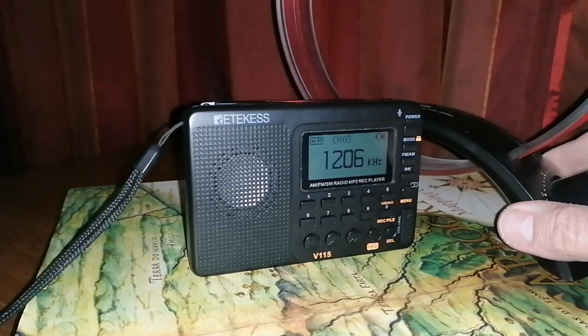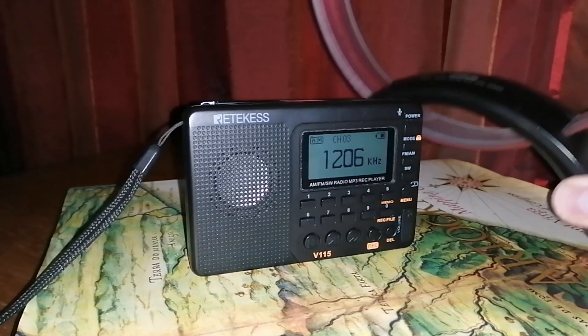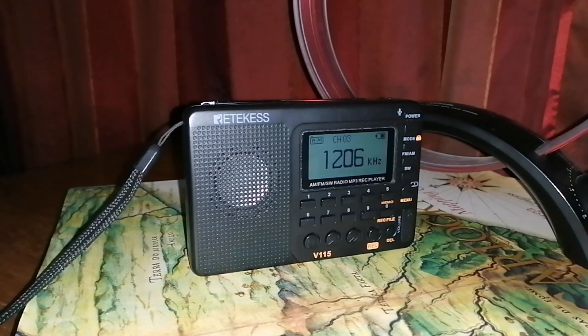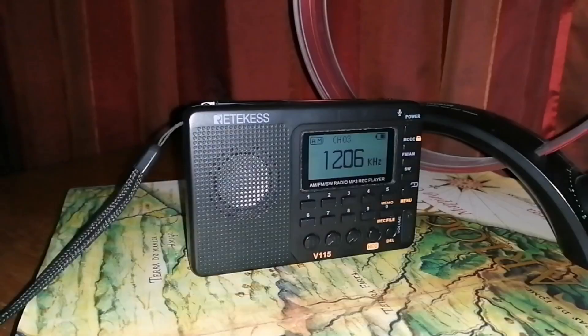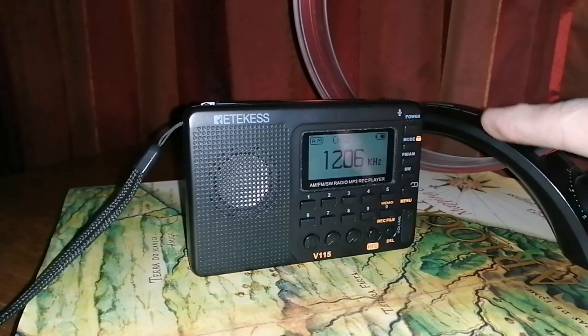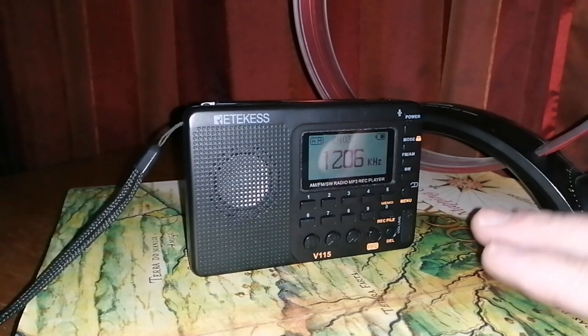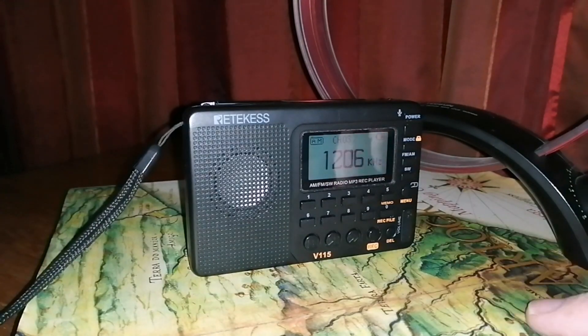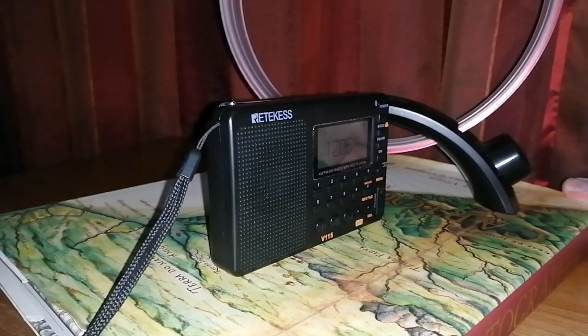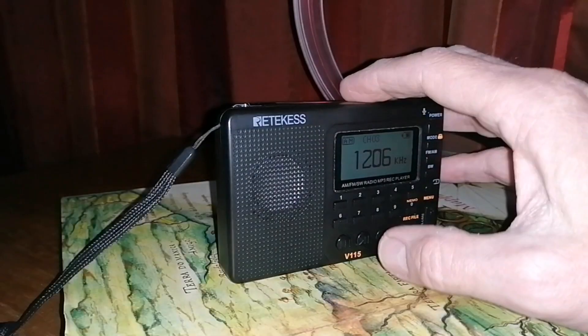If I remove the antenna, I'll show you again. Now, this position of your antenna — the way it's paired with this radio — is your best position, so you don't want to change that. You do want to change the direction, because this is a directional antenna. That is why we use the book or the lazy Susan — on different signals you will move the book around each time to get the best possible reception. I'll try another Mozambican signal.